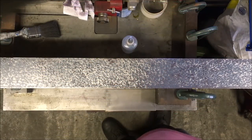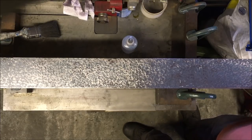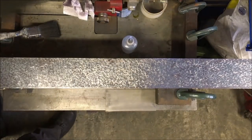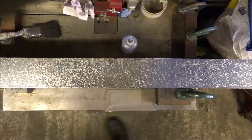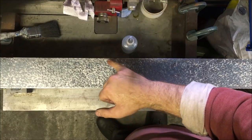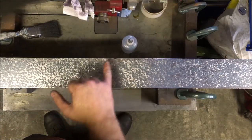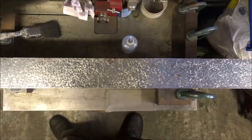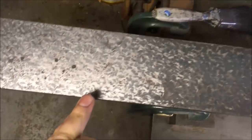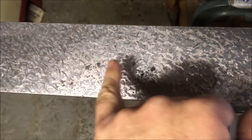You're going to have to excuse the poor framing up, but I can't get the camera any higher up. I'm happy to call that good enough. It's a pretty damn even distribution, and the only areas where it's below 25 points per inch are where there's a lot of rust that I haven't been able to dig out for the depth, which is basically two areas, one there and then... See if I can bring you over. This area here. And the only way I can get past that is to actually fill in the rust holes. And I can't be bothered.